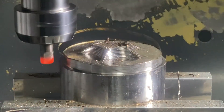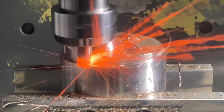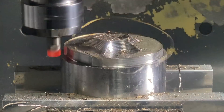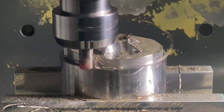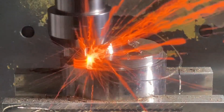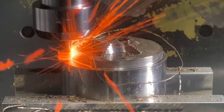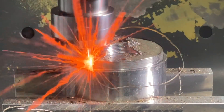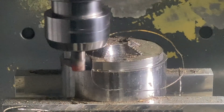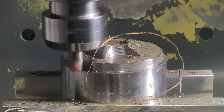So now we're past the five, six minute mark. It's just running nonstop and it looks absolutely beautiful. The sound hasn't changed, nothing has changed. This is when you start really realizing that this process of removing Inconel is actually incredibly efficient. That's why they say ceramics is the most efficient way to rough nickel alloys.